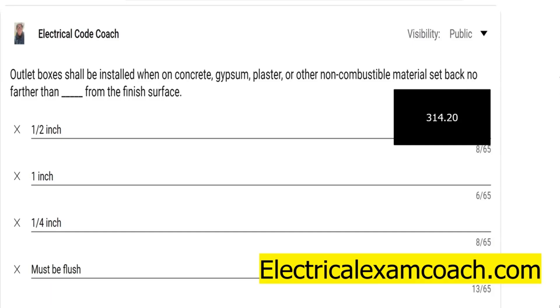Now let's talk about if you run into a scenario where it is recessed. Let's say you came up to a paneling wall and the box is recessed a quarter of an inch. What you do is they sell box extenders — they sell them for metal and they also sell them made of plastic. Depending on how far inset you are, a metal one would have to be a very large inset, but a plastic one will buy you a couple of inches. So even if your receptacle box was inset a couple of inches, you can buy some of these extenders as long as they're listed for the use, and you can extend that box out and bring it back flush where it's required to be.